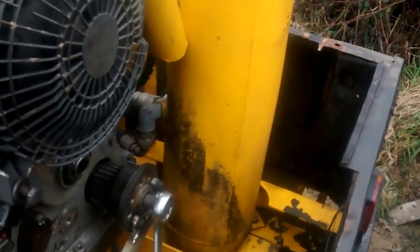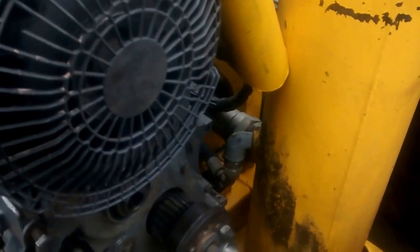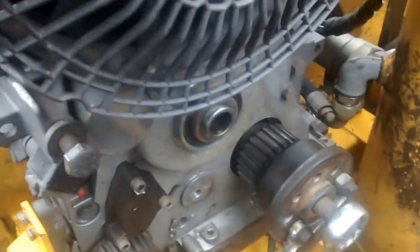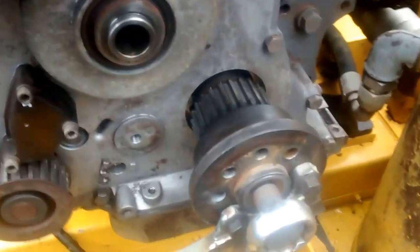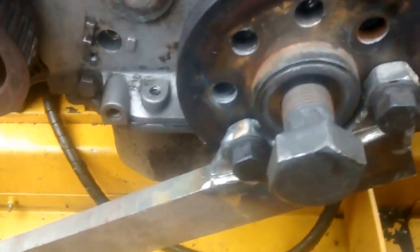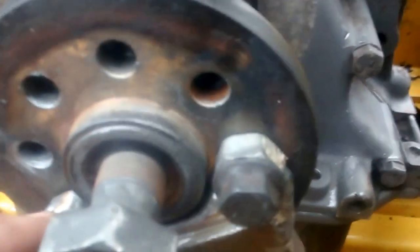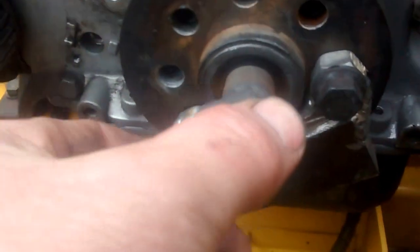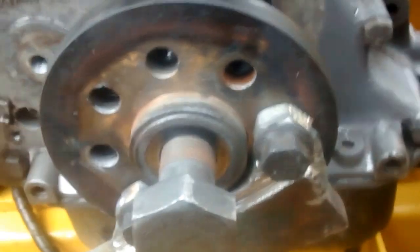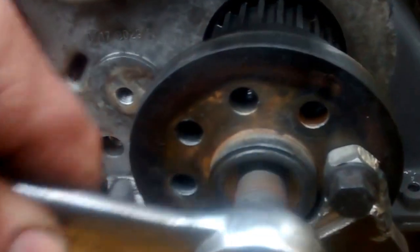For people doing the cam belt and the tensioners and have an oil leak problem, which this compressor does have, you'll need to take the main engine crank drive gear off, which is located here. To achieve this, you'll need to make up a kind of bracket to locate onto the flywheel or onto the pulley and then exert pressure on this big bolt anti-clockwise to undo. Obviously you'll need a breaker bar, impact driver, or a big spanner with a bar on it. It is tight.